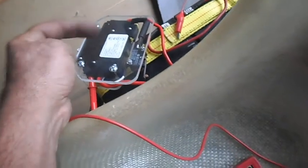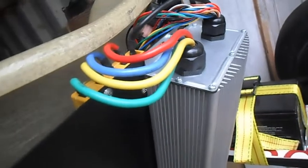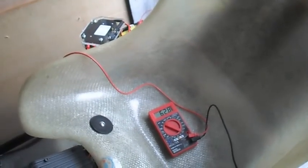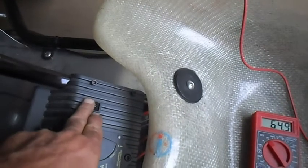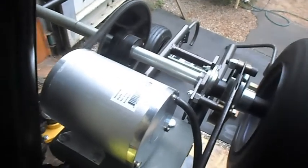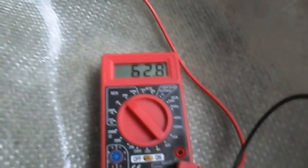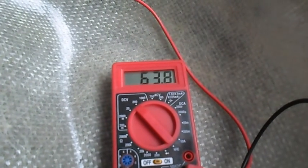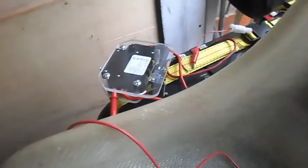It's this way — when the switch gets turned on now, the switch won't see a hard inrush of current across the contacts. Also, the capacitors in our speed controller won't see that huge inrush either, because they've already been filled up slowly with our pre-charge. Now we can turn our breaker on — the system is energized. Now we get almost a 2 volt drop with very little load. That demonstrates our pre-charge circuit.